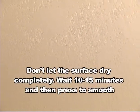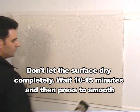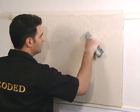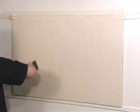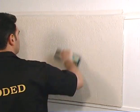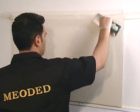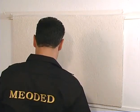The textured layer should be about 80% dry to the touch, which should take approximately 10 to 15 minutes. Now go back in with your trowel and smooth it out again, but this time with a lot of pressure, making the surface very smooth while leaving large holes of texture. Remember to always work in one to two square yard sections if you're working alone. Don't let any area dry before you can go in and create the texture.